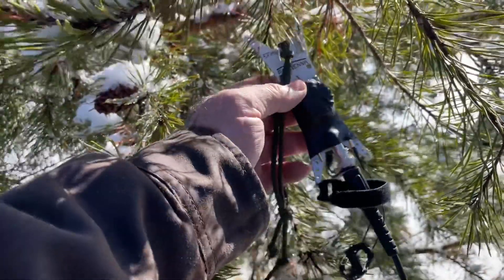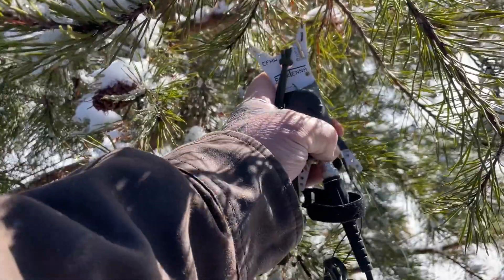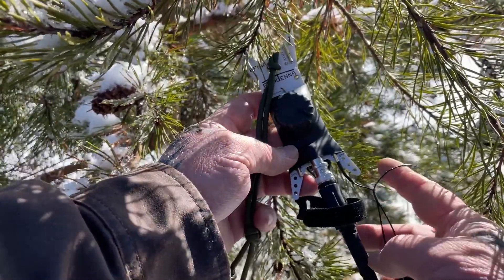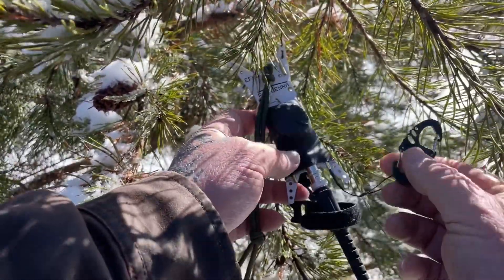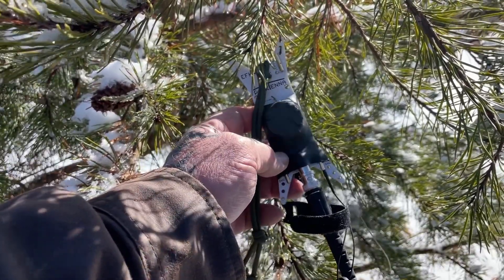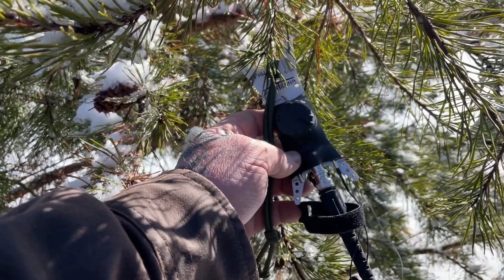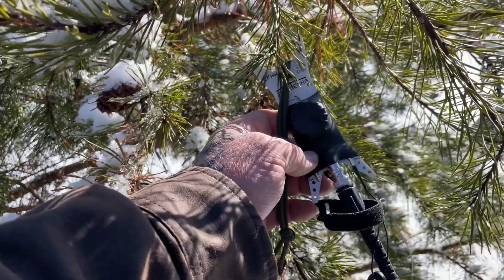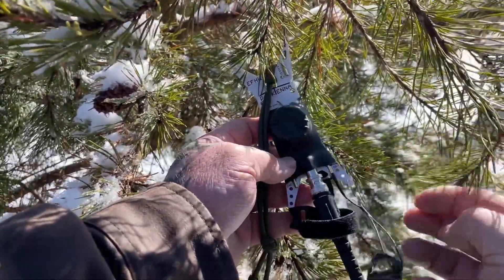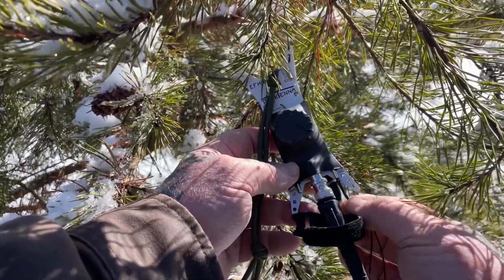One of the great things about the versatility of this antenna is that it also has places to hook another wire to make it a center dipole, and it has two ground wire connections for radials. So I've taken another length of wire approximately the same length as the 40-meter wire I'm already using and I'm going to use that as a radial. It's going to be very close in proximity to the other wire since we're only about four and a half to five feet off the ground. I want to see if that makes a difference in our radiating pattern for NVIS and maybe gets us even closer — trying to hit Ohio, Indiana, Kentucky.